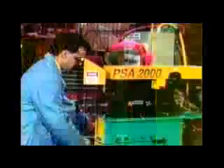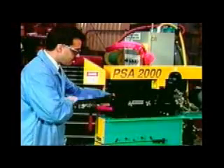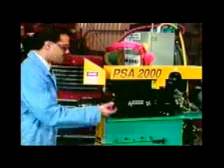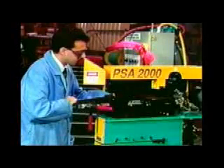The Guild PSA-2000 is the only portable and stationary end welder that offers the customer a choice between manual and pneumatic clamping. The manual clamps can be used for all gauges of material. Unlike pneumatic clamps, the manual clamps can be positioned anywhere between fully opened or fully closed. This makes manual clamps ideal for light gauge material because the clamps can also act as a strip support table, assuring the strip is positioned properly in the weld station prior to final clamping.